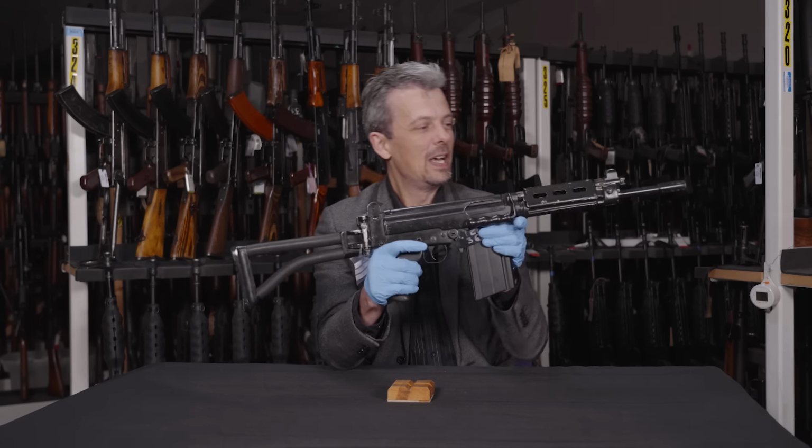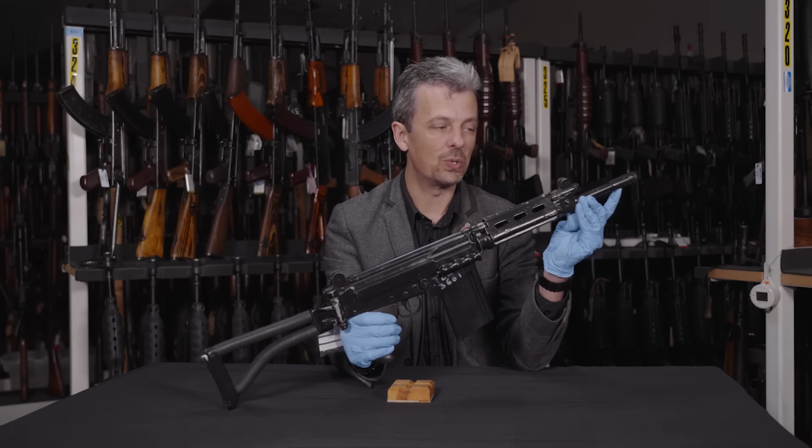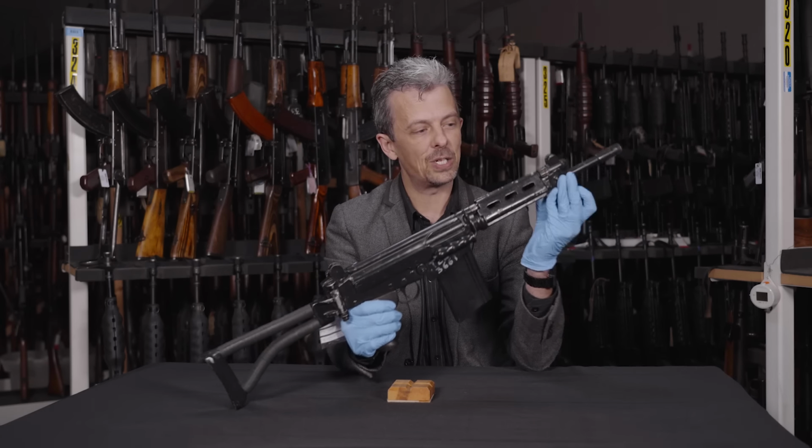With a very short barrel is all sorts of wrong for most users, but there have been a few who have favoured it. So yeah, the barrel has been shortened by, I think it was 274 millimeters. So we actually have an inspection report from our armourer on this because, well, it needed looking at in detail. So the barrel's been shortened. The flash hider itself, or the flash suppressor, has also been shortened. It is a standard FAL flash suppressor, but it has been shortened. The gas block has been relocated further back, shortening this whole setup here, and the handguard is super short as well. So it gives it almost sort of cartoonish proportions.